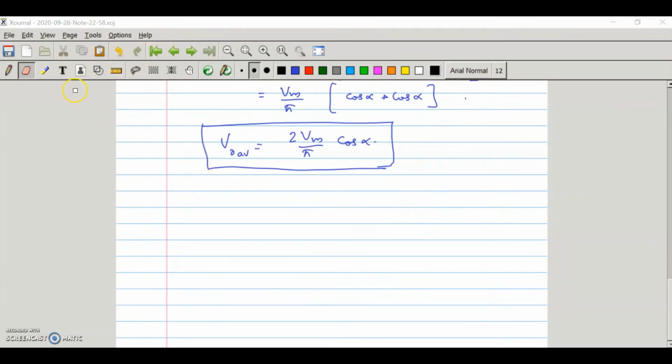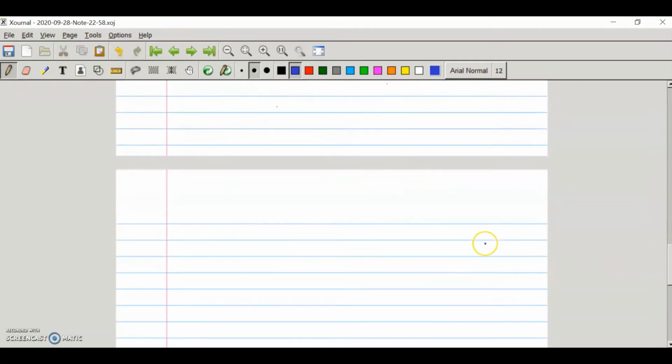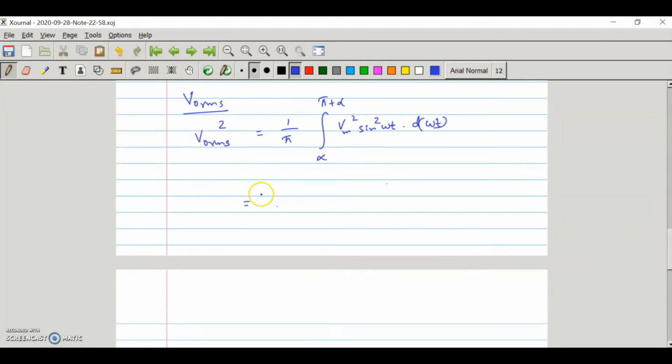And V naught RMS is equal to, RMS value of voltage, we can find it as, say, V naught RMS square of that, let it be equal to 1 by pi integral alpha to pi plus alpha Vm square sin square omega t d of omega t. So that is Vm square by pi integral alpha to pi plus alpha 1 minus cos 2 omega t divided by 2 into d of omega t, so that we can write it as,